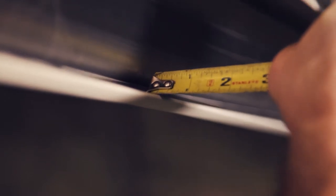The reason you would adjust these is if you notice that your gutter lip that you hang the hangers from is either too large or too small. By adjusting your entry guide and auxiliary post entry guide we can increase or decrease the lip.